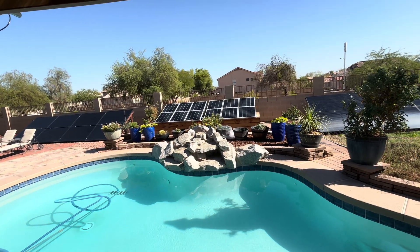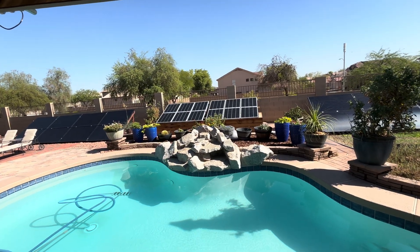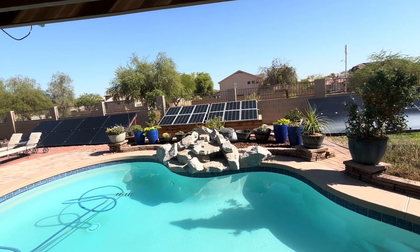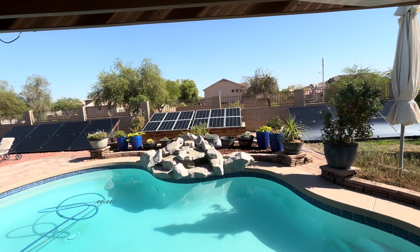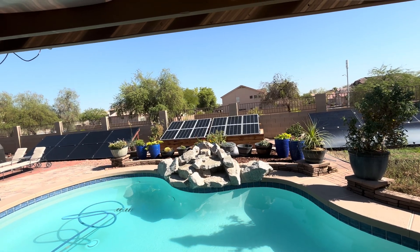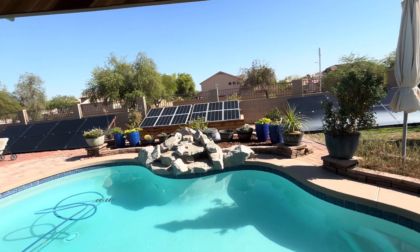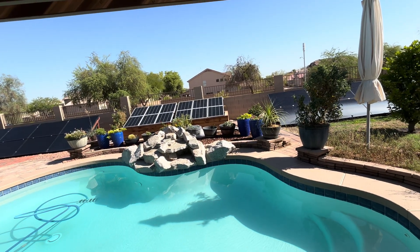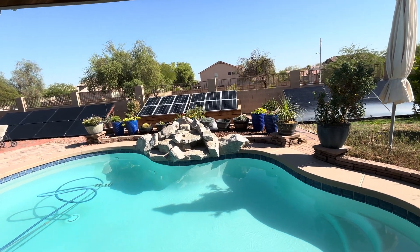I run it in my garage — it's a three-car garage, pretty close to 600 square feet, maybe like 550. It does a really good job out there. The better the insulated room, the better it's going to do. If you put it in a very uninsulated garage with no drywall, no insulation, and metal garage door with sun shining on it, you're not going to get the results you expect. It might get you down to the 75 to 85 degree range. But I can get my garage down into the 60s because it's well insulated.